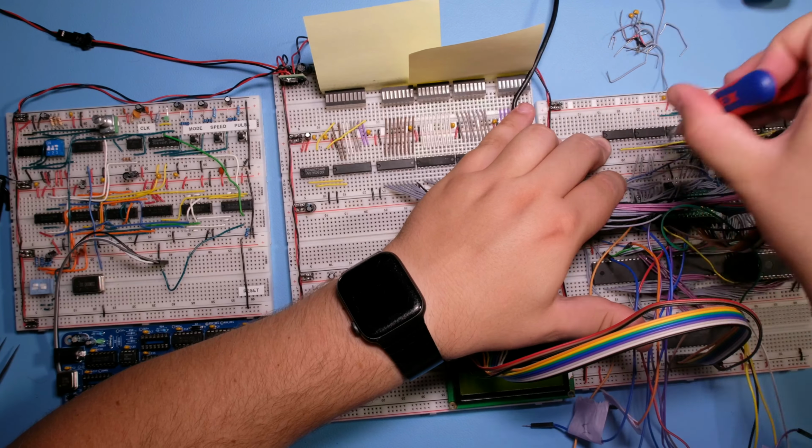this. Then I made some PCB versions of those little LEDs and buffer arrangements. So I'll be putting here four of them, like this. I'm not gonna touch the LED and the buffers for the control signals here, because there's some work I want to do on that. But this should free up this area of the breadboard.